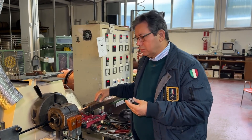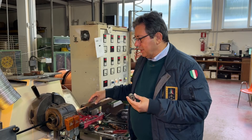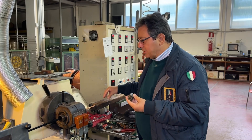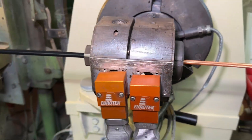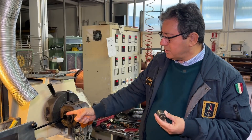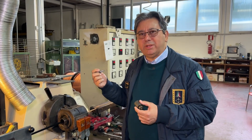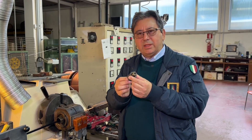The braided coaxial cable, which is not a coaxial cable yet, will become a coaxial cable starting from now. The braid is going through the extrusion head and coming out with the jacket. Just the braid goes in, just the jacket comes out. It will pass through the extrusion head where it will receive a layer of PVC, polyethylene, or another jacket material, and it will pass through these dies.